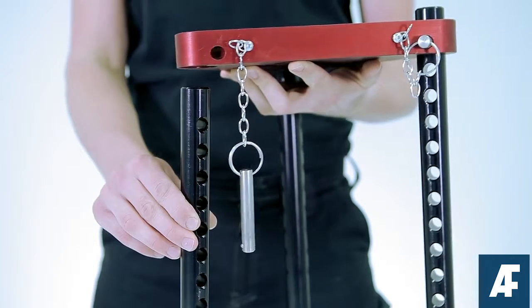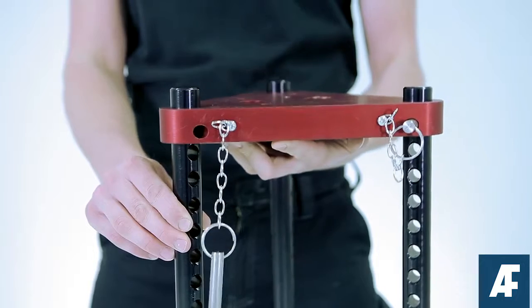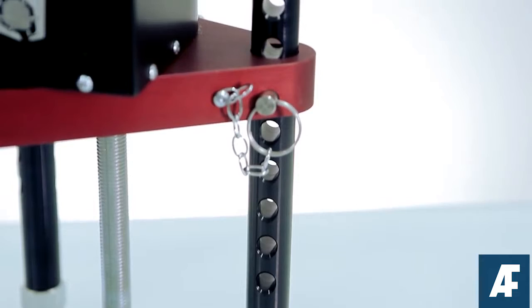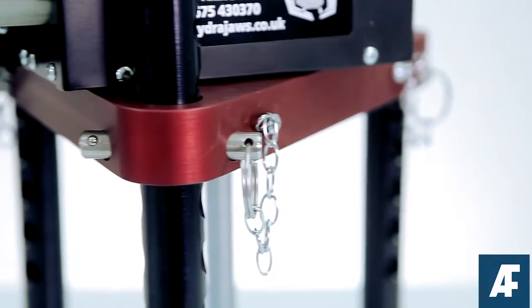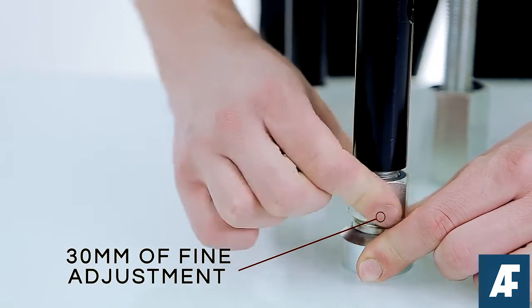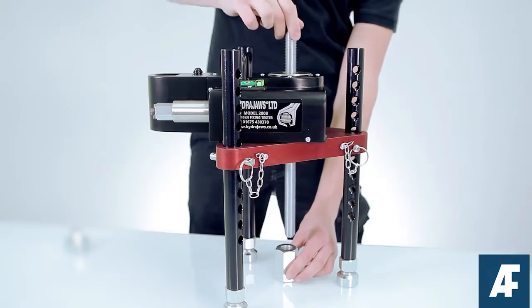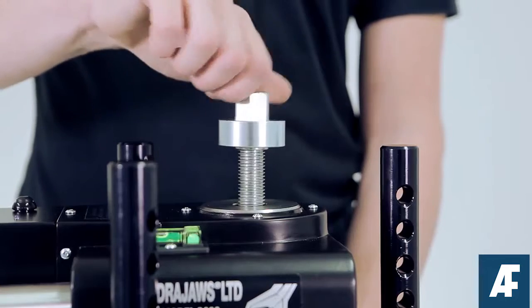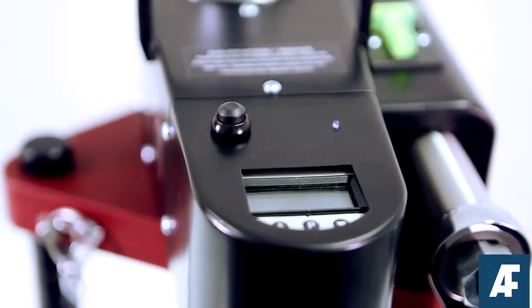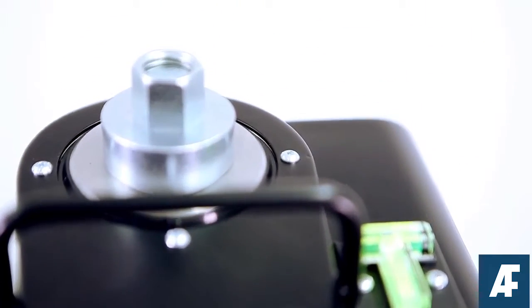The bridge is easy to assemble and adjust. These fully adjustable telescopic lightweight aluminium legs offering 11 height positions are held in place with steel ball pins. Each swivel foot features an additional 30mm of fine adjustment. This compact design of tester and telescopic load spreading bridge is lighter and more convenient to apply than a separate hydraulic pump and cylinder arrangement.